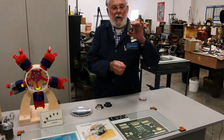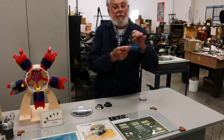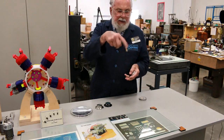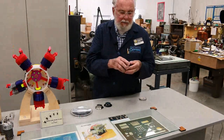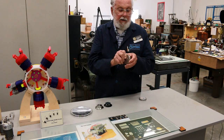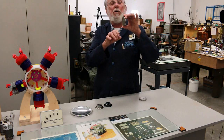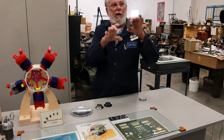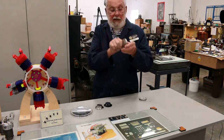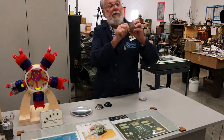All those factors go into causing this to do what's called spoiling. If you've ever taken a coin and held it on its edge and flipped it, it will spin for a couple of seconds — it won't spin long because it does not have the right proportions, the right ratio, which is six to one. So if this disk were one inch thick, it would be six inches in diameter. If it were three inches in diameter, it would be a half inch thick. This one is about two and a half inches in diameter and a little over three-eighths of an inch thick.